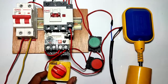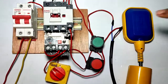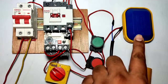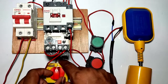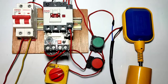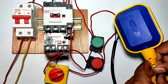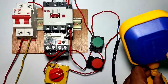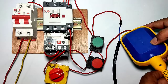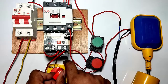Now let's learn how the control wiring works. For manual operation, select position one — you can start and stop your motor starter manually anytime you want. For auto operation, select the selector switch on position two. When the tank is empty and the tank level is low, the float switch goes to the down side, and your motor starter will start automatically. When the float switch goes to the up side, your motor starter will stop automatically. By this connection you can control your motor starter manually by push button.